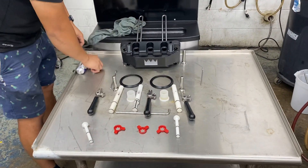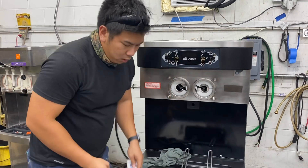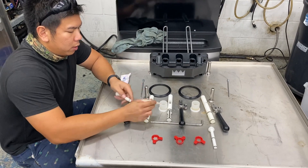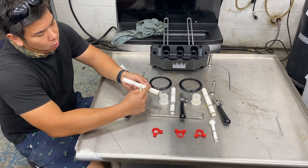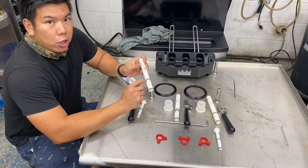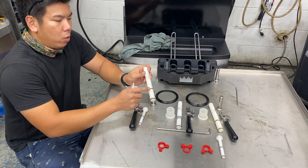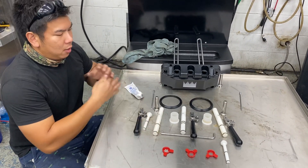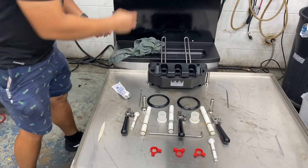You'll need lube and your O-ring remover tool. When you have everything apart, use this tool to remove all the O-rings. This is where you inspect to make sure everything's still rounded and not flattened out, because in a pressurized machine you want to make sure your seals are good. If they're not, the pressure is going to force the product through and you'll get a lot of leakage. That's basically the entire disassembly of your door.